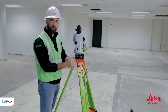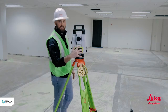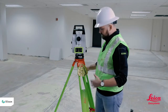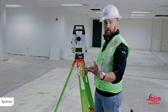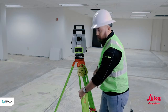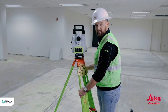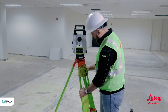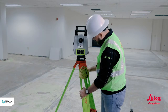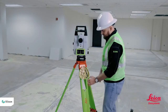After that we're going to level up the tripod a little more because you'll notice it's crooked. I use the bubble level right there and adjust the tripod legs up and down to make it match. Pro tip: I like to place my thumb right here and grip around it, so when I release the foot peg the tool doesn't drop down. By squeezing my hand here it makes it a lot easier to adjust, because little adjustments on this thing make that bubble jump a good bit. I'll get it as centered as possible — looks like I'll have to adjust one more leg to get it centered up.